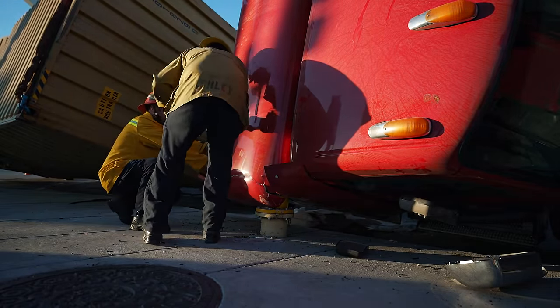This is definitely something that would have buckled if you only had one rotator in the middle. Again, like I was trying to explain earlier, imagine you have one line right there in that pocket. Your truck boom head is right there in the middle above that M. And then the other line is in that pocket. So you have a really high extreme angle. And as you winch in, because of the damage in the middle, how it's bent, you're pulling it apart. You're bending it. It'll rip it for sure.